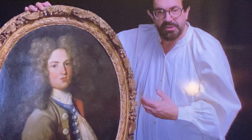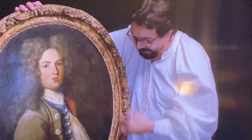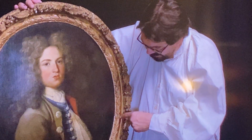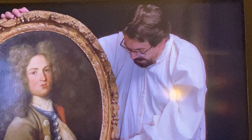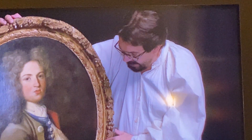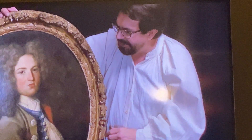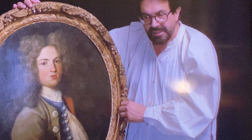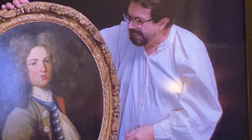Then we'll go through cleaning — the whole frame. This frame has remnants of gold paint throughout the upper ornamentation, which all has to come off. Looking through to the gesso, I can see the red bole layer of clay. As we've talked before, you can tell the country of origin by the color of the red or yellow bole clay. This is definitely French — so if someone tried to sell you this as Italian, it's not. We're going to get the whole frame in preparation for gilding. This frame is going to come out bright, with great contrast between burnished and recessed areas.